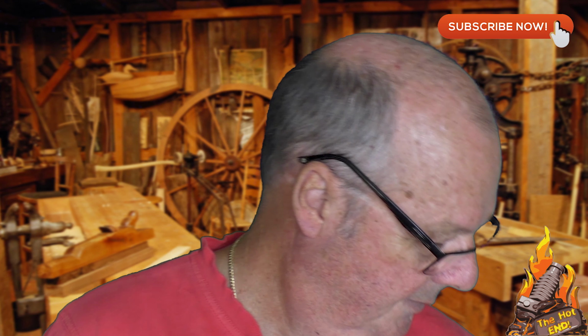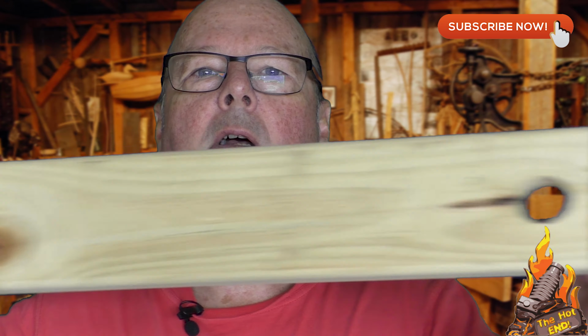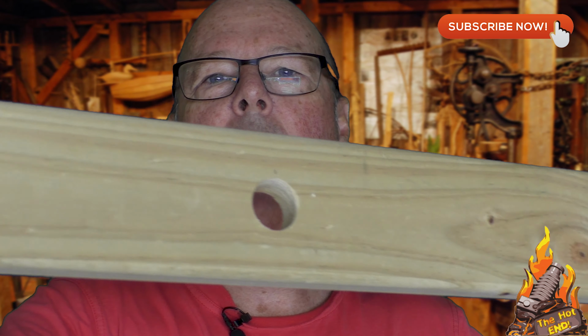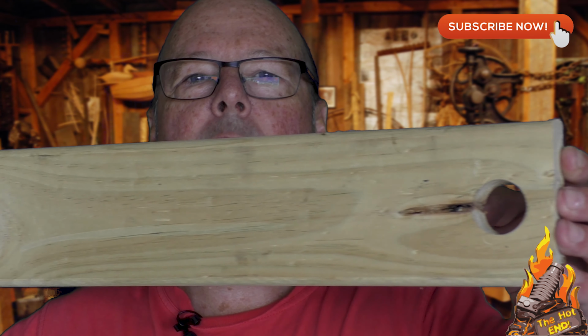Clamping. When you're putting several pieces of timber together to make a tabletop or something like that, you need a big clamp. I don't have any big clamps. I forget what they call them, pipe clamps, sash clamps, parallel clamps, you name it. So this was an idea of Izzy Swan. You just get a couple of pieces of timber, drill some holes in it about where you reckon the size of your tabletop's going to be, like so.